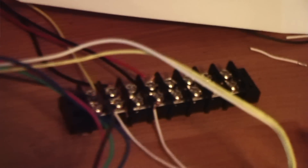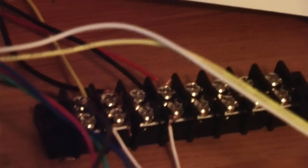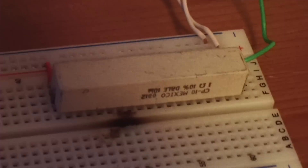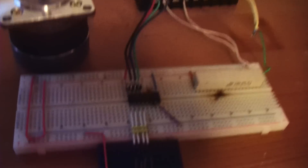This right here is just the terminal for the DC power supply for a regular computer — ATX jump, basically got it turned on. It's running off 5 volts, going into the red board. It's a 1 ohm resistor; it gives out about 4.4 amps from the actual power supply, so we want to tone that down because this chip can only handle like 500 milliamps.